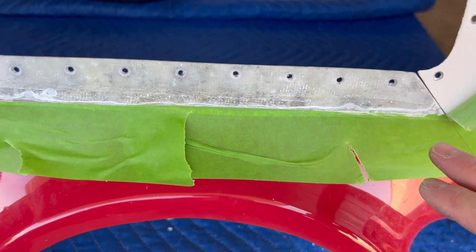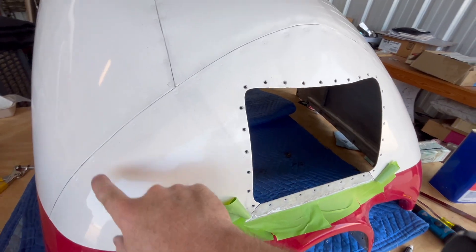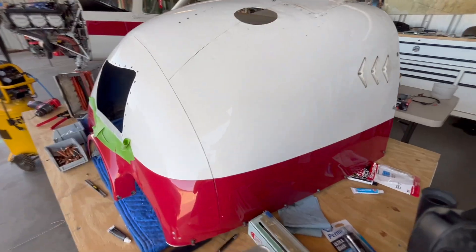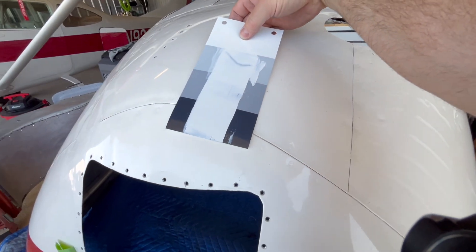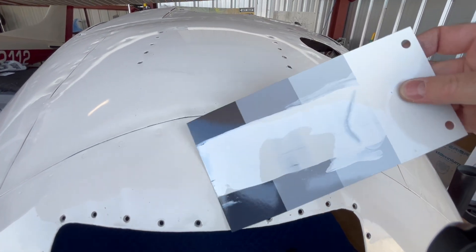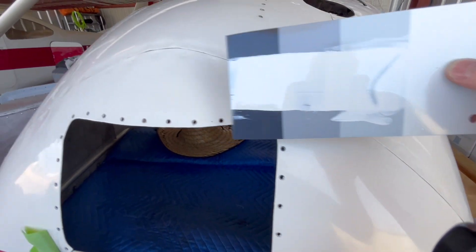That was a lot of fun because I've got a paint line here I don't want to destroy. I'll probably end up painting the whole front bowl, taping off this line and this line, and painting this whole section. I went and got some paint matched from a pretty awesome local store — Arizona Automotive Paint. They matched my paint for me, so I've got some real nice single-stage catalyzed acrylic urethane paint. Now I've got the paint color for the airplane — looks different in different lights. Thanks for watching, guys — let me know what you think, I love to hear the comments, criticism, and compliments.